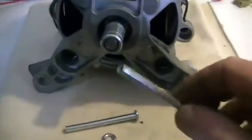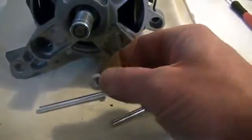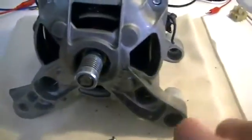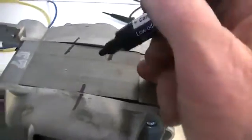We've drilled our pins out. All they are is these steel pins with a washer on the other end — the pin is squashed over so the washer can't come off. They're all gone. Now a good idea, even before you drill it out, is to mark your carrier plates and the stator. This thing is wobbly because it's only got three legs — one on one end, two on the other. That way you can line it all up and it goes back together how it came apart.